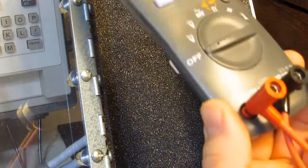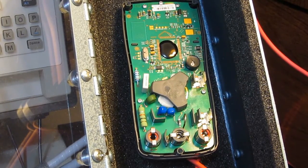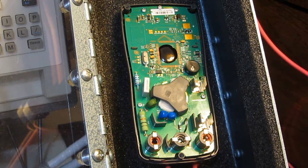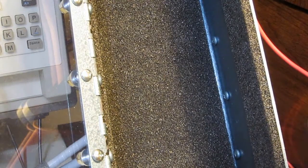We're going to start with the Fluke. This will be a 5000 volt transient without the half cycle line simulator enabled. I'm not expecting to see any sort of breakdown. It looks like nothing happened, so we'll try it a second time. Okay, doesn't look like anything happened — I'm not too surprised.